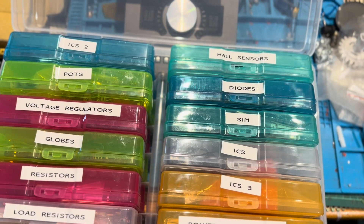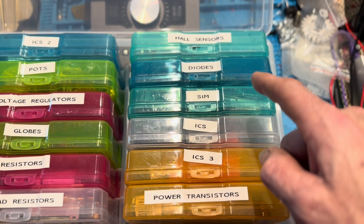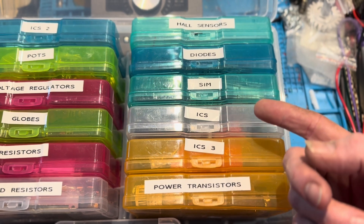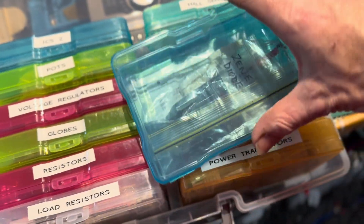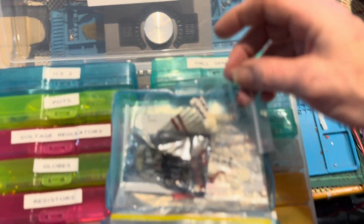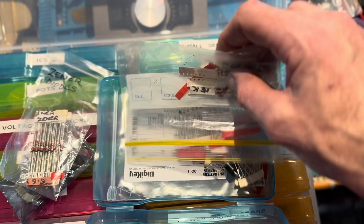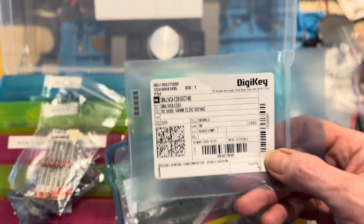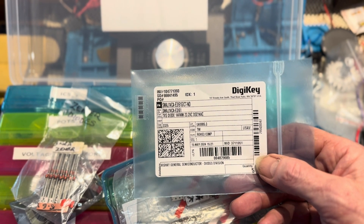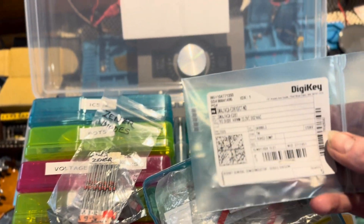Three weeks later I finally have the parts I need to fix the UAD satellite interface properly. In the last bit I showed you I used a diode to get it going — well I found out it's actually not a normal diode. Let me show you what I've got. I have a whole bunch of different types of diodes: Zener, Schottky ones, but actually the one we need is this thing here — it's actually called a transient voltage suppressor. The ones we need are actually 14 volt ones, and they have a really strange coding system that you can't identify very easily from the numbers.